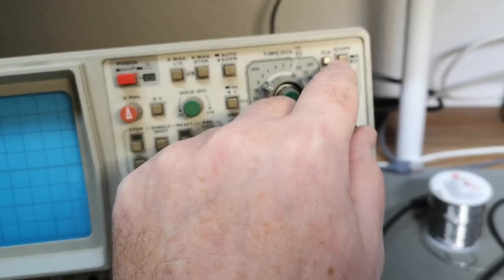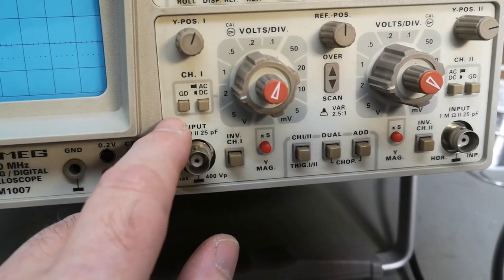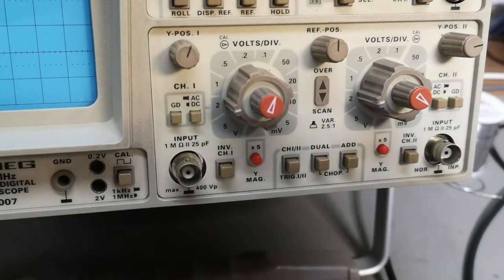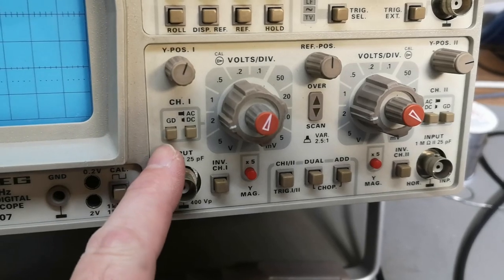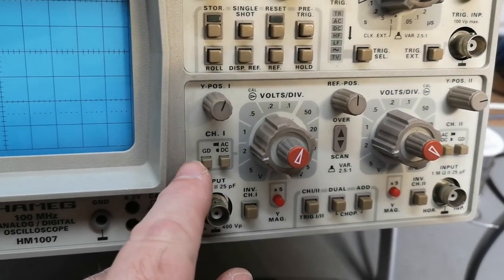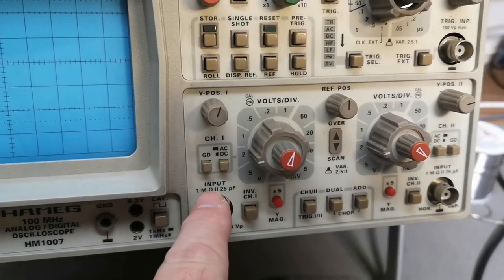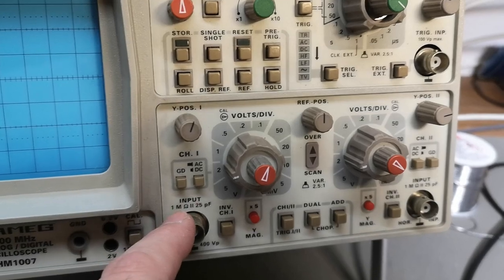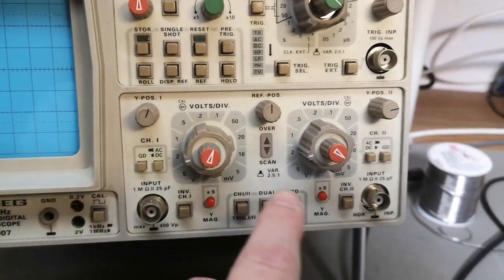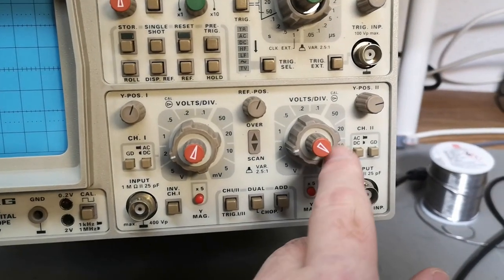I also find something here — this button is the grounding button. Why would you want a grounding button? That is just the most stupid thing in the world. What I really want you to do if you get a scope like this with the grounding feature: open it, cut that wire, and put a 50 ohm resistor in there instead and change this to 50 ohm. Then you've got a feature that is very very useful when you're running fast — you want a 50 ohm termination, not a grounding feature. And what is that scan over ref position for? I can't wait to play with this — I really hope it works.